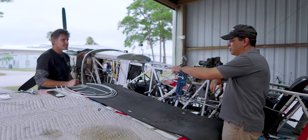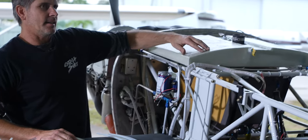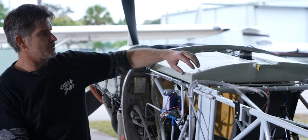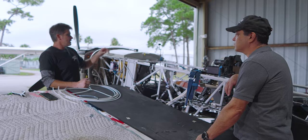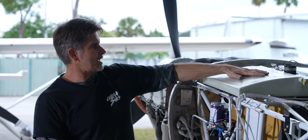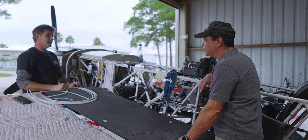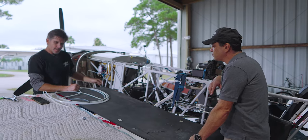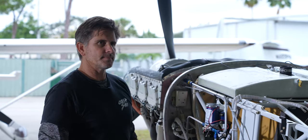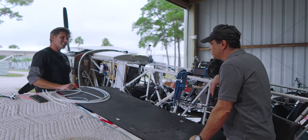And what are the pipes and hoses here? These are vents. These are actually aluminum tanks — they look like composites because they've got a composite shell on the outside, but the shell is there to contain any fluid in case the tank leaks. There's a drain on the other side, so if it ruptures, the fluid will get between the skin and the tank, drain out, and make a puddle at the right side of your gear — that's how you know if there's a leak. There's also a vent for the actual tank itself to displace air and fluid as it moves. Are there any check valves on those? No, none on the vents — only on the supply system.